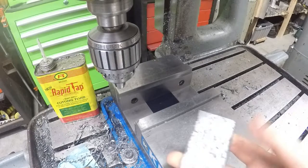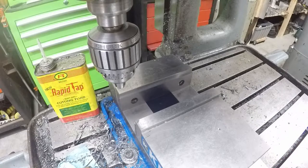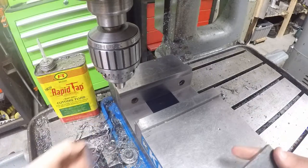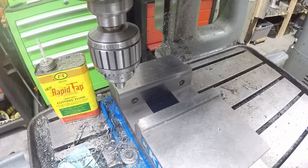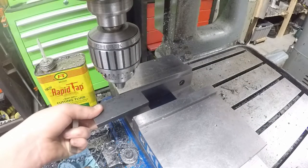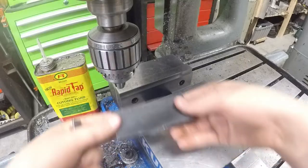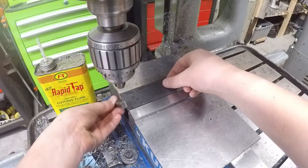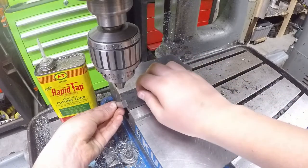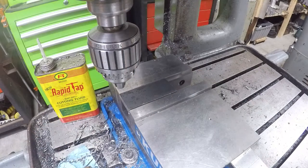So what we're going to do now is take our part, our piece of steel here. We use these Rex 98 things — high-speed steel tools. We take those and put them up against the hard jaw on the vise. You don't want to put it on your moving jaw, because sometimes your moving jaw can be a little bit off, and if you're in a precision-ish scenario, you want it to be perfect. So in our case we've got to close the jaws in about three-quarters of an inch. Now we've got our jaws reasonably close to where our part's going to be, so we put our part in. I call it the aligning tool — Rex 98 aligning tool, high-speed steel tool, whatever you want to call it. Make sure it's up against that edge. You can't have your part moving. Now we can go ahead and tighten that down and check it again.